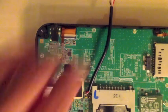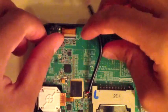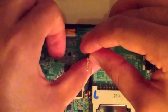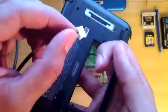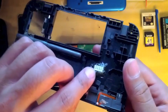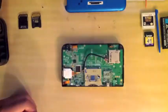Put a crease in your wire so that it fits underneath the bottom cover. Now we're going to solder those wires to the butt connector on the inside of the bottom cover. I need to stress that colors need to line up here — it's going from the NAND all the way to the SD card, so make sure everything lines up and all colors match. That's very important.